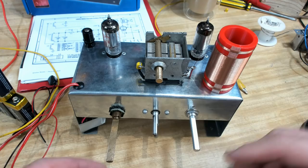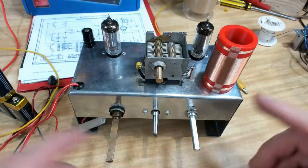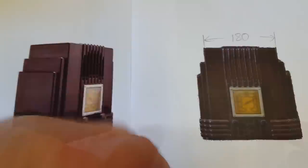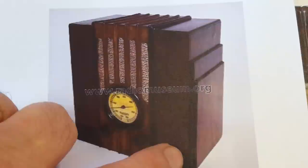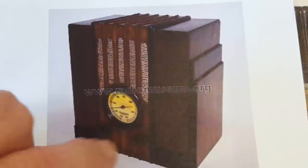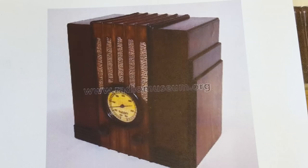I'll go to the workshop and work out the proportions — height to width — and I need to leave enough room for a speaker, plus a little dial somewhere. I looked at the front and side view of the Empire State radio I was going to mimic the styling from. The original Bakelite version I can't replicate in wood in half a day. But there's a 1934 Empire State made of timber with much the same styling. Basically it's got two panels on the sides, it's a cube shape, with some highlights and a bit of fancy work across the bottom that I can mimic.